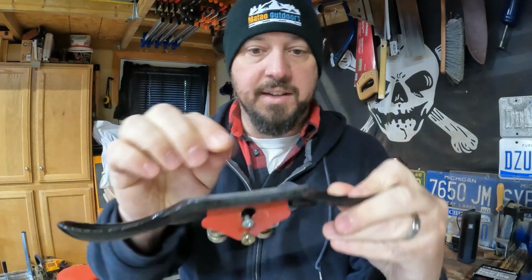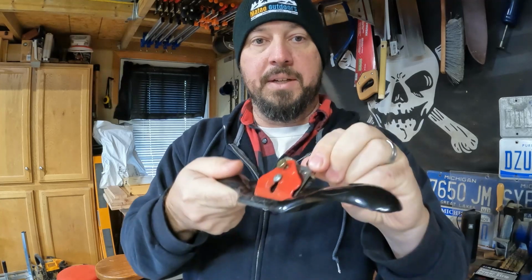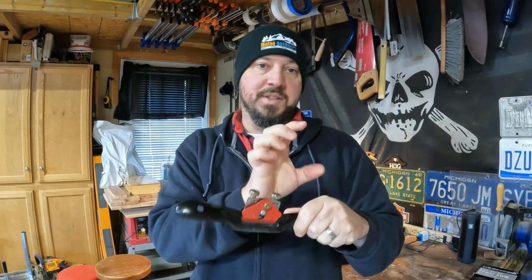They come in a lot of different styles. They have ones where the belly, the bottom, or the sole of the Spokeshave is kind of flat, like this one. You can see it's flat, and there's the blade protruding through. They've got some adjustment screws up here to set the depth of the blade or the thickness of your cut. There's one on each side because you can make one side of the Spokeshave cut pretty aggressive and the other side cut pretty smooth. So you can take those aggressive cuts, shape your piece, and then use the other side to feather it out and smooth it out.